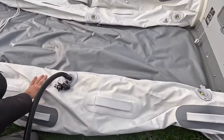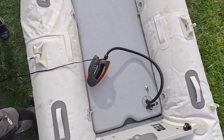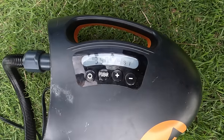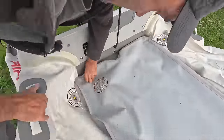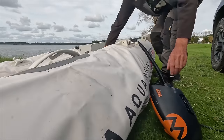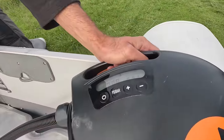This boat comes with four air chambers — one in the front and one in the back on each side, plus the inflatable hard bottom which is another air chamber. The side pontoons inflate to 3.6 PSI, and the drop stitch bottom inflates to 15 PSI, same as a paddle board. You cannot inflate the boat in one go — first inflate the side pontoons on each side to about half, then put the hull in and inflate it fully, then inflate the side pontoons fully as well. Otherwise the bottom won't fit if you start with fully inflated side pontoons.